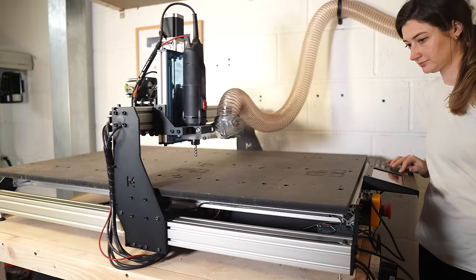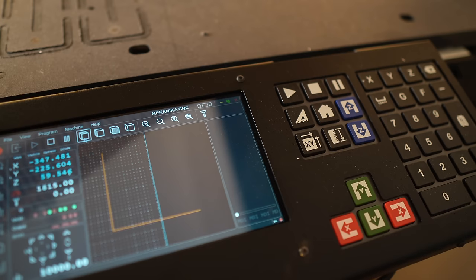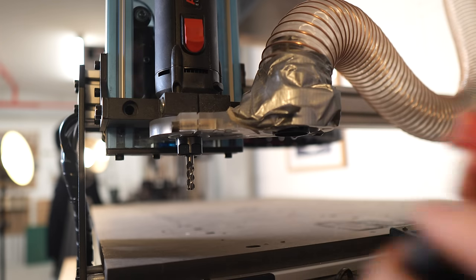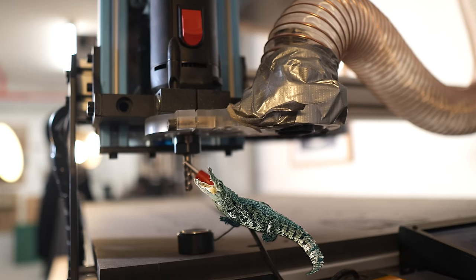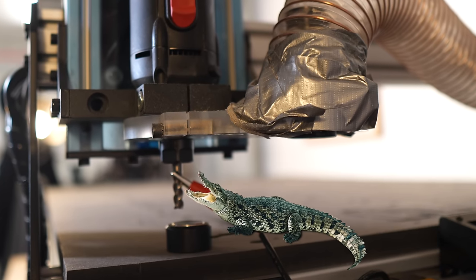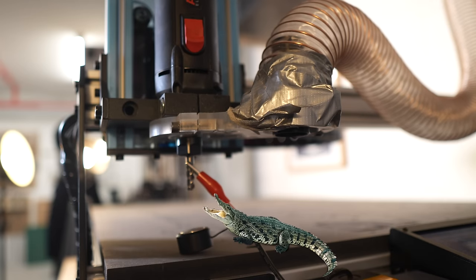I really want to get started with a headstock template, so let's go. What I'm performing here is the basic calibration stuff you have to do when you turn the machine on: setting it to home, squaring the gantry, and setting the height of the bit. My personal favourite — using the probe to measure the distance of the drill bit from the spoiler board. We clip that little crocodile clip on there and then we hit a button. Then when it touches that steel — yay.